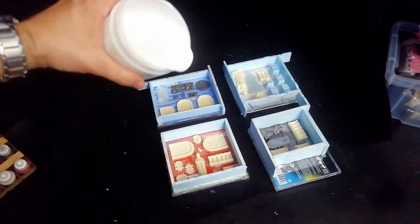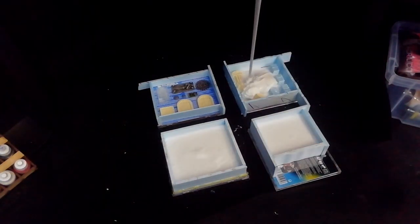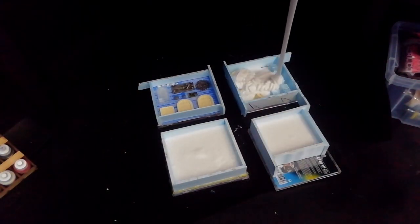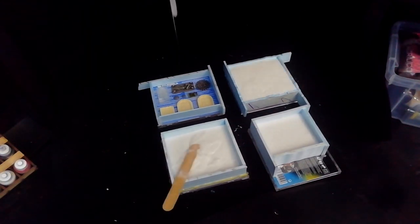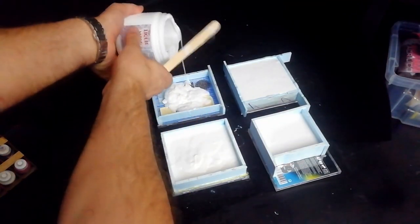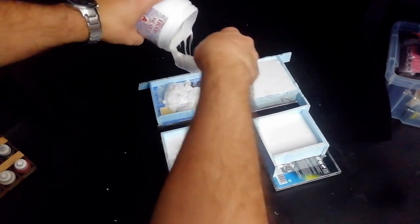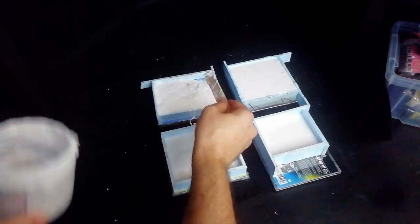The choice of silicone must be made considering several aspects: mold rigidity, as I prefer rather rigid molds for resin pieces, and drying times. I prefer slow silicones, which allow me to intervene with corrective action in the first hour of drying. Calculate the volume of liquid you need to use, not its weight. A good trick is to fill the molds with rice or couscous and calculate what volume of silicone you will need to use.